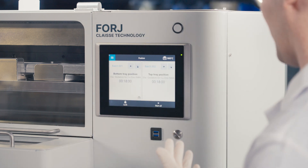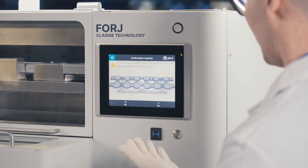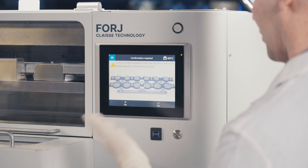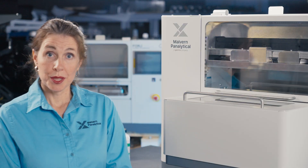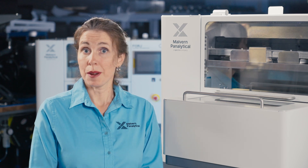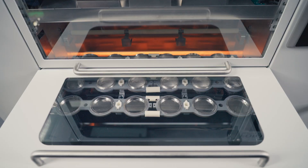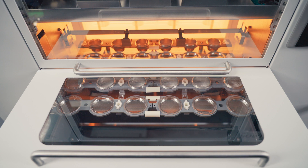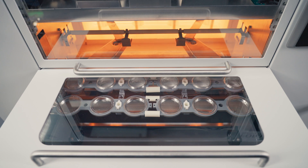Both programs are now in waiting position. We have ready crucibles, and if we start all — temperature is stable, right crucible, cassettes in the right position — we will be starting both batch one and two. The handling mechanism works the same way as shown in the previous Trayloader video. The first batch of crucibles and molds is brought under the camera to confirm they are properly installed before entering the furnace. During this time, the next batch of six crucibles is waiting.